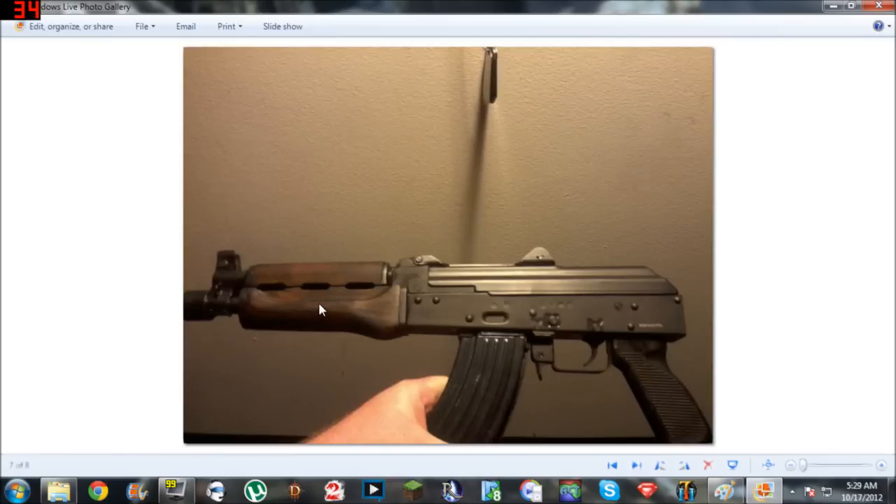It took a few days for the stain to really soak in, but it turned out exactly the way I wanted it and gave it a nice, dark, old wood color. If you're thinking about doing this, it costs about $6.50. You're going to want to put a coat on like once every three or four hours, four or five different times, until it completely soaks in. I didn't sand it at all because it was brand-new wood with no coating — just open-grain wood. So I just applied it, let it sit a few days, and that's how it turned out.